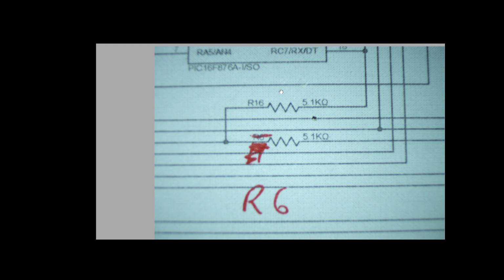one thing I've had issues with is periodically the signal here where they connect together is the common I/O going to the interface to the hand controller and through the hand controller to the PC. And when I connect to a PC, the signal coming back from the controller, either one of these gets attenuated to the point where I lose mount control. But when I'm back on these areas, it's fine.